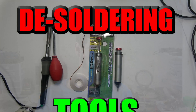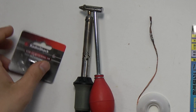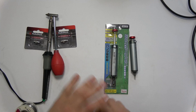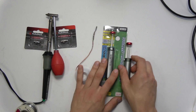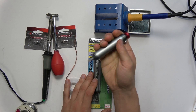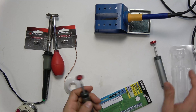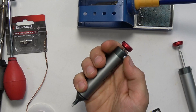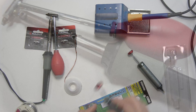These tools are situational — you use different ones based on the situation. You have the solder pump, which needs new tips because they wear out. You also have solder wick, which you use to wipe the solder off after removing a component. Then there's the Engineer SS-02 solder sucker. On a brand new one the pump comes out vigorously, while on a used one it's a little slower — they wear out.